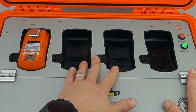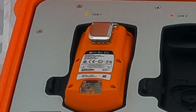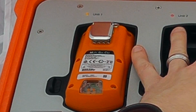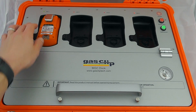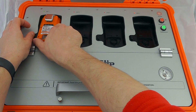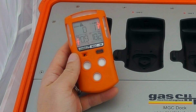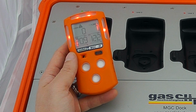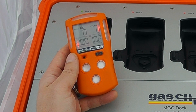It's acknowledged that there's only this particular device in the dock — the other three parts have been switched off — so now it's performing a bump test. You can probably not see at the moment, but this has an amber light and the other three have got red lights. When the bump test is complete, we've got a nice green light to let us know that the instrument has been bump tested successfully as per configurations. It will be in a standard alarm setting when it comes out of the dock. We just need to let it aspirate and get a nice clean fresh air, and then that's a bump test complete.